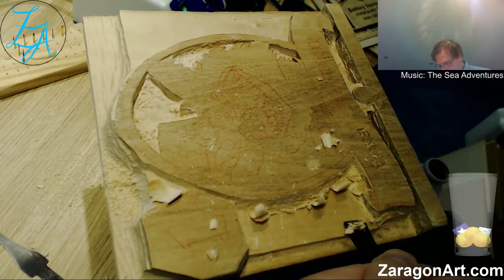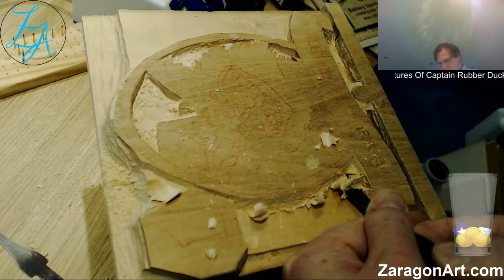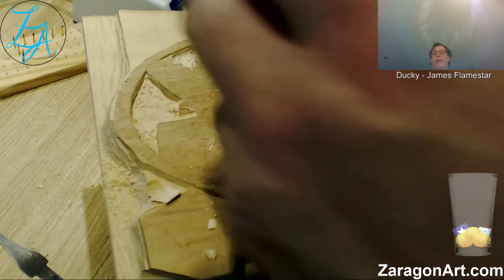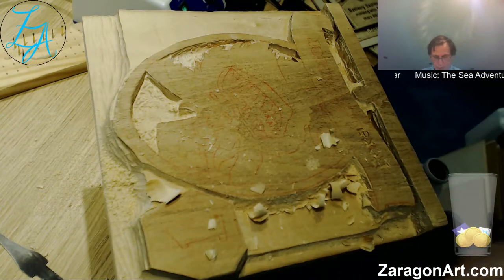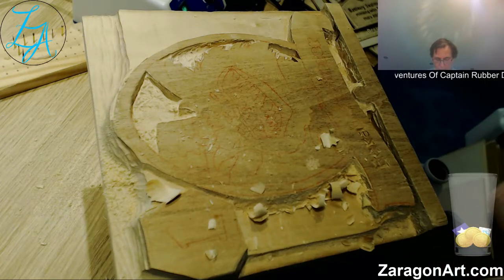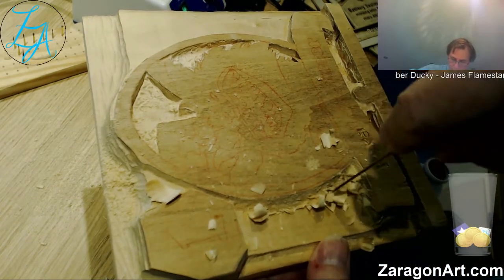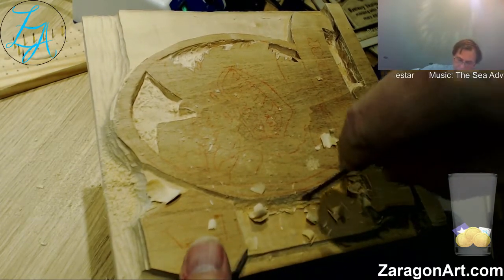Of course, you can do things to help it carry on, like if you were ripping a piece of paper. You put too much effort into it and you'll carry on past the gap, but as long as you're not overdoing it, which you shouldn't really be when you're carving, then stop cuts are what stop you ripping the wood and going into areas that you didn't mean to.